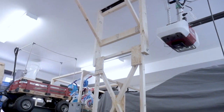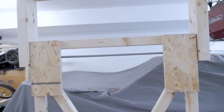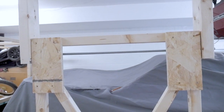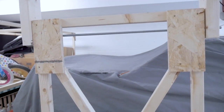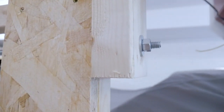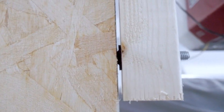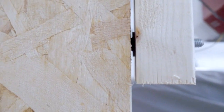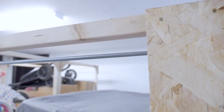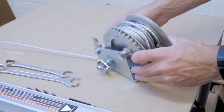With the stationary frame now in the correct position, I could take the swinging frame and mount it up with that 3/8 inch rod and hang it from the stationary frame. You can see here that the 3/8 inch rod goes through both frames and the swinging frame pivots about that rod. If you look closely, in between the two you can see the flange bushing, and there is a gap maintained between the two frames in order to prevent them from binding and rubbing against one another.